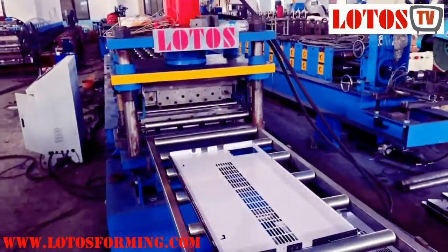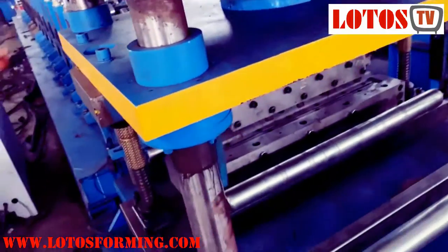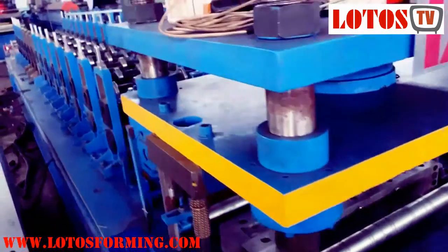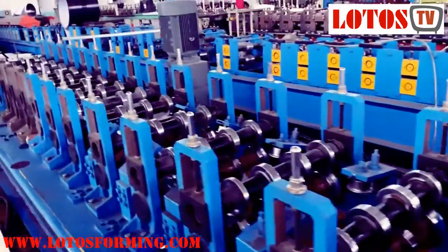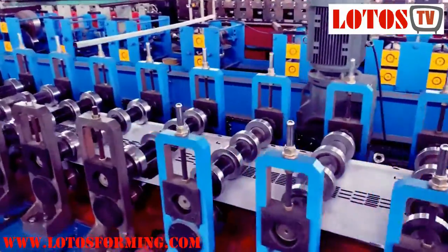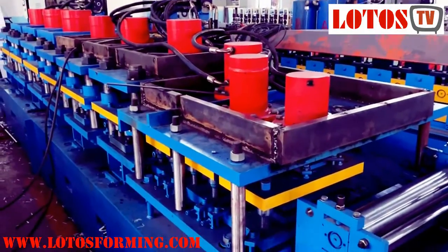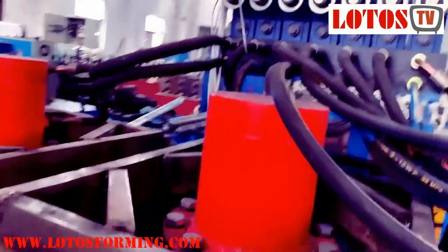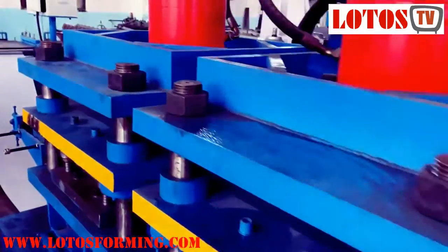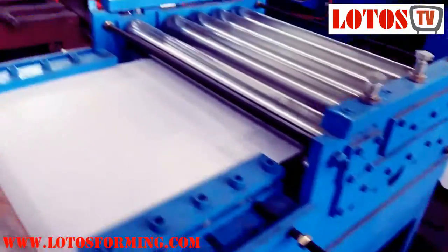Now I'm going to show you the line. Here's the output table, and especially for this cutting and bending die. If you've already followed our latest YouTube channel, you will understand this kind of die function and how the bending cutting is applied in our lines. Here is the forming machine. In the middle there is one big punching station — it has about nine punching dies. The advantage is that you can select the punching die in the PLC system.